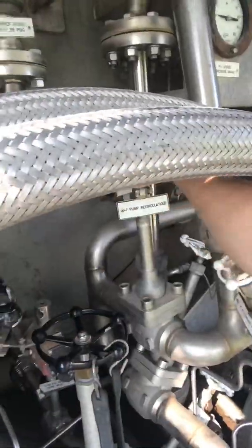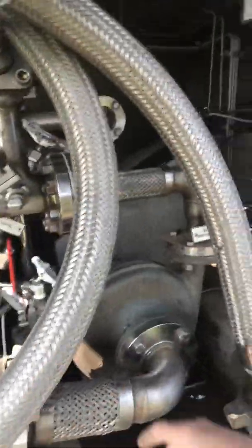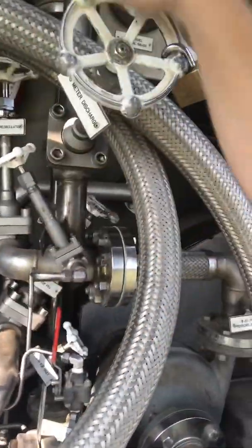When you're done, kick your pump out. Open your recirculation before you shut your discharge so the fluid has somewhere to go. When I unhook everything, I shut my main valve, shut my recirculation, and leave my discharge open — because if you totally isolate that pump, shut your discharge, shut your recirculation, and shut your fill, that nitrogen has nowhere to go and it'll build up to 400 or 500 pounds of pressure really fast. You'll blow your pump up.